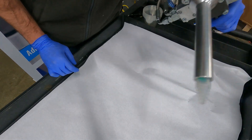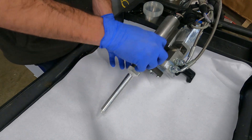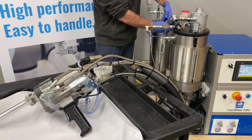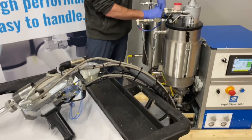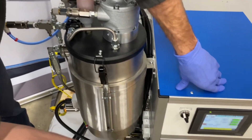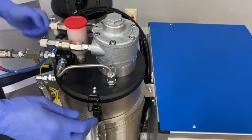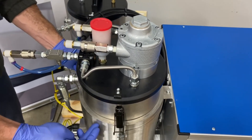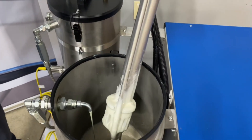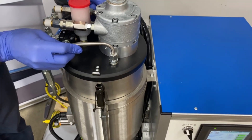It is a lightweight handheld valve on the end of a two meter hose. Both materials are separate until the very end of that valve — both materials are pourable, flowable liquids that go in their separate reservoirs. There is a low level alarm that I will mute. On the base resin side we have the heated reservoir along with the air nucleation so that you can pump air into the foam, which makes the reaction that foam materials need and require.